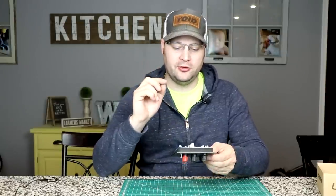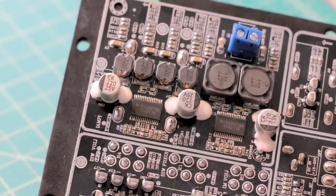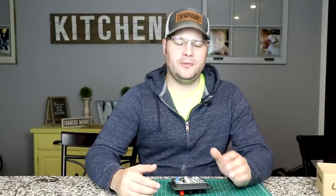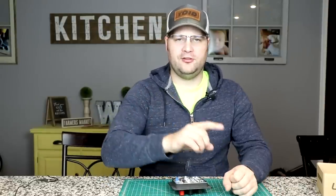This is a 2.1 powered by two chips — the exact same chip, the TPA3118. One is not bridged and powers the left and right terminals. The other is bridged and just powers the subwoofer, meaning you get double the power to the subwoofer. For example, if you give it 100 watts of power, 50 of those watts go to the subwoofer and the other 50 go to the satellites — divided between the left and right speakers. Even if you only have one speaker hooked up, you're still only going to get 25 watts to each speaker, while the subwoofer gets 50 watts.